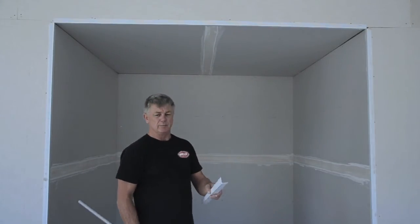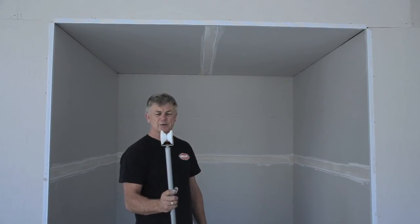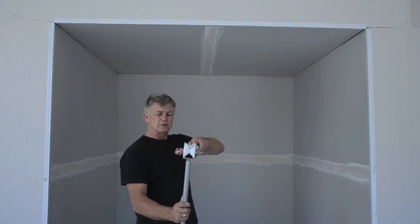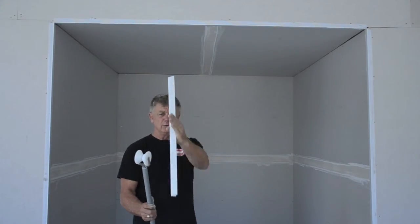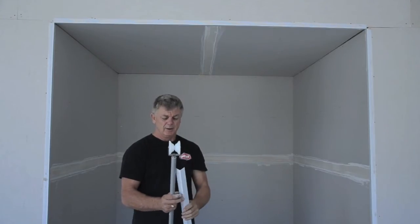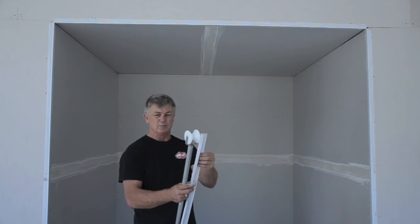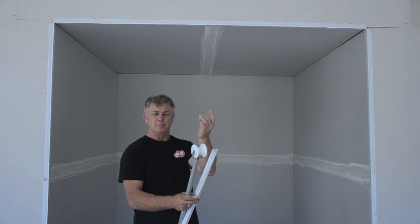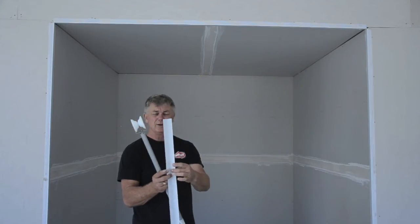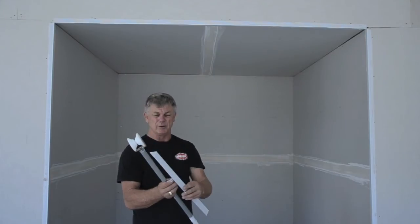Here we go. Before rolling, this is the external roller. There is also a 135-degree external roller. The bead simply slides in — the rib goes into the inverted groove within the roller and that will align the bead straight up and down. If there is any need to adjust the bead, you have the option to move it fractionally with a blade and tip it with a blade, which will recreate the vacuum under the mud leg that has been patented to bond completely with the base compound.